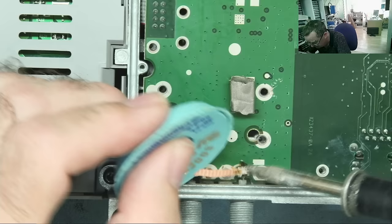properly. Can't see any 680-25s that would actually fit. I've got some poles here. These are 10-25. That's just fine, I would have thought. These things won't be critical at all. This one is marked 105C, same as the other one. Doesn't say low ESR, but there again, neither do the original ones.